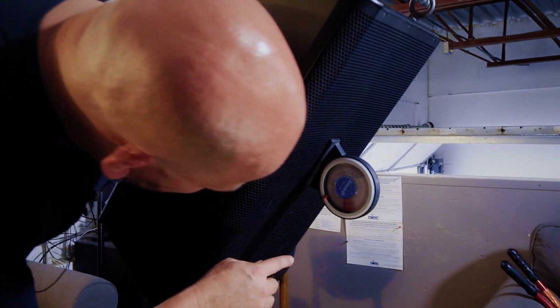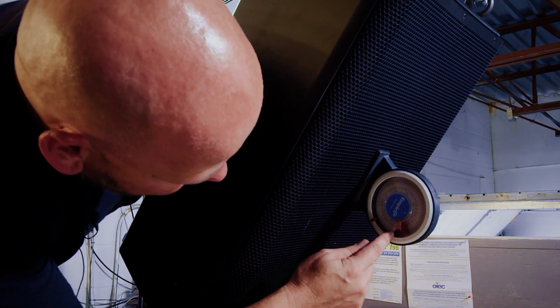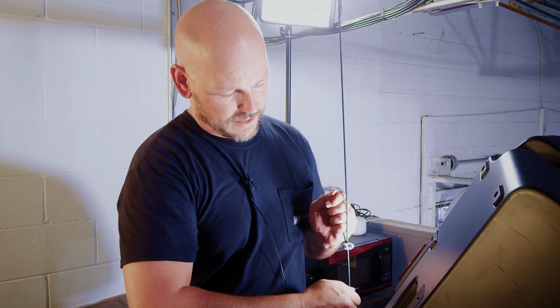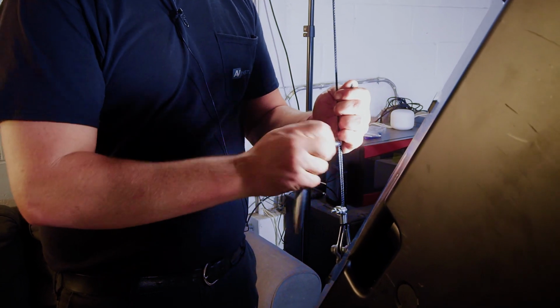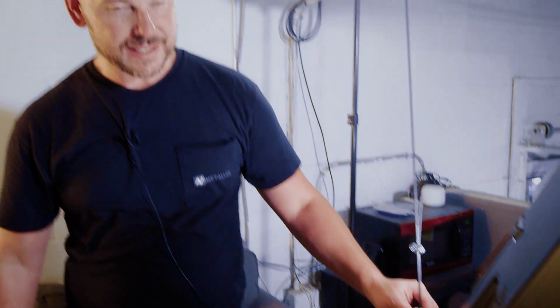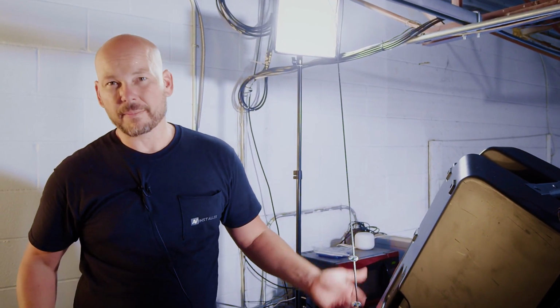So I've made an adjustment, and I went from 40 degrees because we were coming off of 90. That gave me about 4 more degrees, so I still need to come out a little bit further. So I'm gonna try that again. Let's give that one more look here. Now that I'm right on that 60-degree mark, which is 30 degrees off of 90, I'm gonna tighten these down enough to where I feel safe that they're not going anywhere. The last step is I'm gonna swage my copper ferrule in the back. I'm gonna take my Crosbys off. I'm gonna E-tape my leader up. I can even cut my leader short.